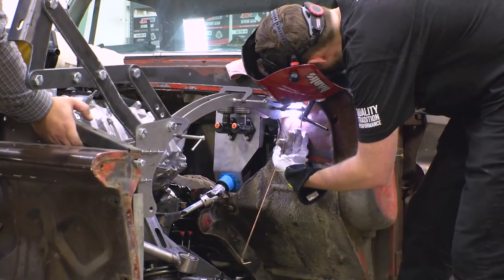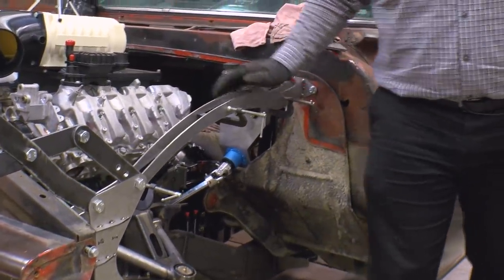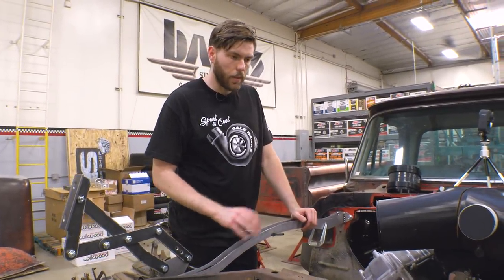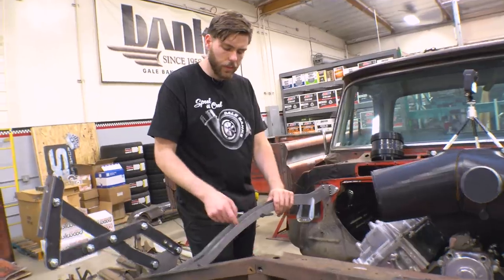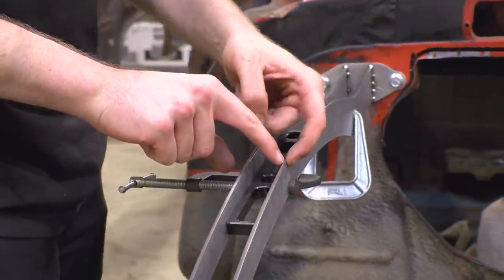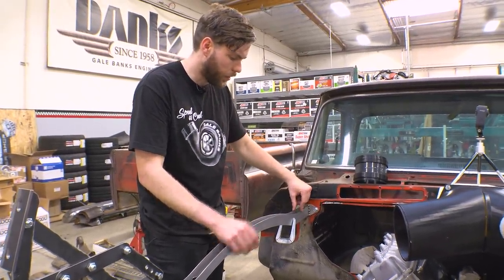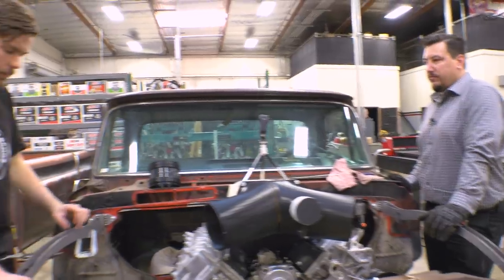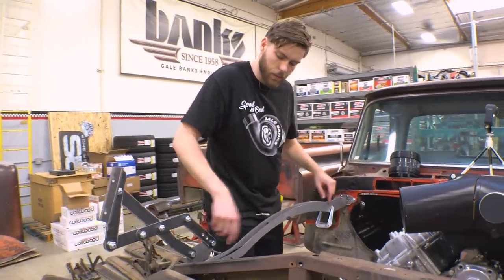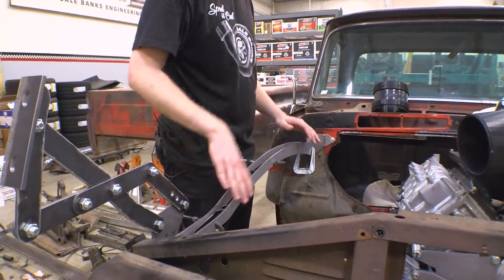Eric just finished tacking up the firewall and core support piece to give it torsional rigidity. What we're going to do is cap this piece with a little bit thinner metal. The beauty of 14 gauge is it's about 75 thou nominal — still thin enough to manipulate, but a little thicker than 16 or 18 gauge, so we'll get extra rigidity. We built these to fit our pre-made fixture tooling, so we have a set width and we're cutting the piece to still have material thickness to capture a weld. I have to make sure the first few tacks are right — if they're off, my overlay will start shooting off to the side. If I do it right, it'll slowly pull itself in as I tack it, push down, tack, follow the contour. Once it's all tacked up I'll weld that entire joint and blend it out — pretend this is a nice organic piece of tubular work when really it's three separate pieces.